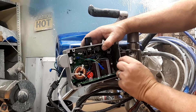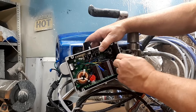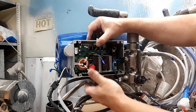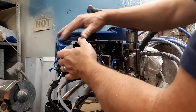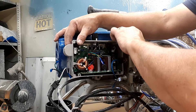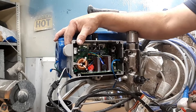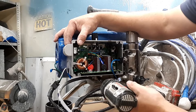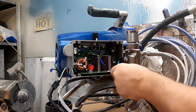Take the transducer bushing and slide it back in the groove. Bring it around so the transducer pushes right back into that hole. Hang it on something, then go ahead and feed your bolt in up here to help hold your box. Don't tighten it all the way down yet — throw your lower bolt in and snug that one up just a little bit. The box is still going to be a little loose.